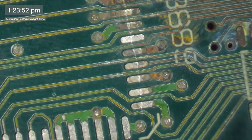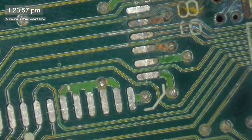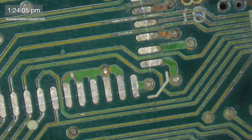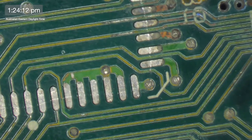We've got to patch it onto somewhere. We'll ideally patch it onto something as close as possible. So let's see if we can find a spot. We don't want the CPU. FPU maybe? No, he doesn't go to the FPU. What that goes to is the RAM mux, the video ROM, the video mux, the sound chip, the CPU, and the PDS slot J13. Oh god, where's J13? Oh, it's going to be fun to find.